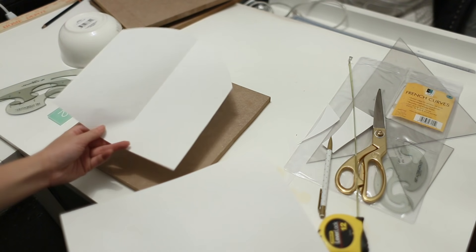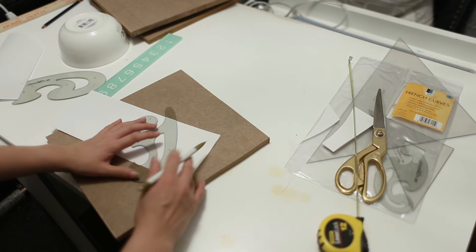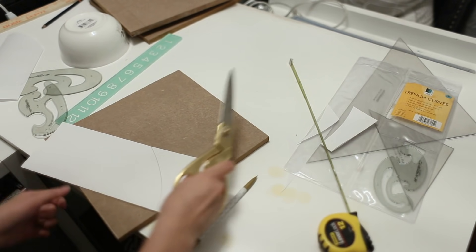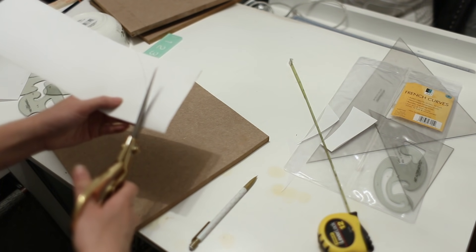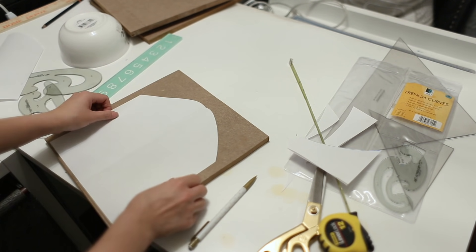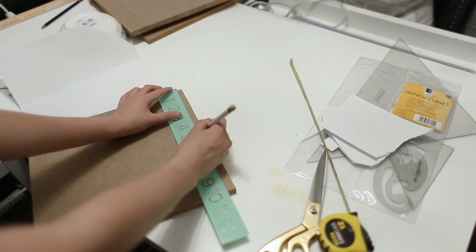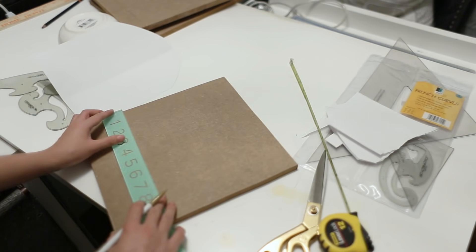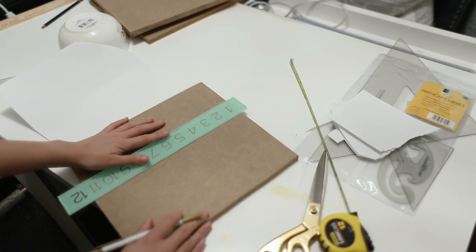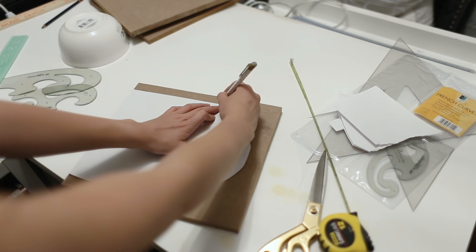To cut the door for the gazebo part on top as well as the base for the litter box, I took a regular letter-size paper, folded it in half, drew a curve, and cut it out. You can adjust it to make it more or less round, or add a pattern. To place it on the boards, I marked the middle of the board and matched the middle fold of the door template to center it directly in the middle, then outlined it with a pencil.